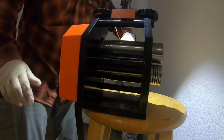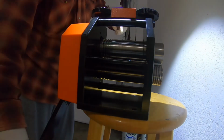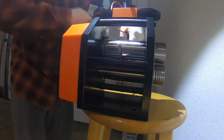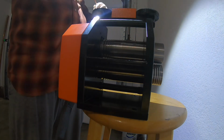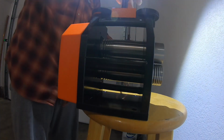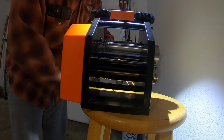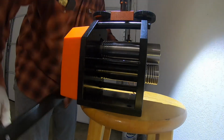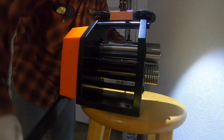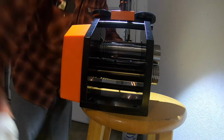So after doing some research, I figured the problem was probably not being pickled, being dirty, and the solder melting away due to excessive heating. I did go ahead and order some flux, although my solder is non-flux solder, so that that's not the issue. Today we don't have the pickle yet, we don't have the flux yet. So today we're going to lower our heat and make our joints smooth and see if that doesn't help.